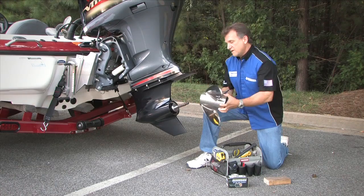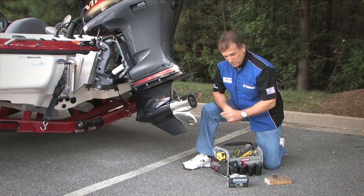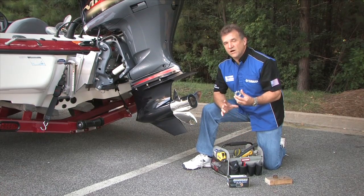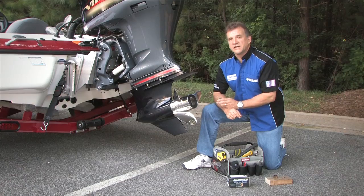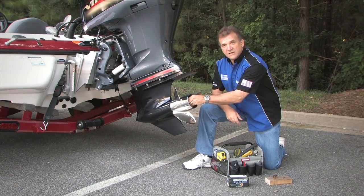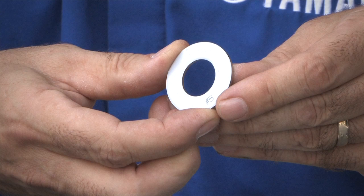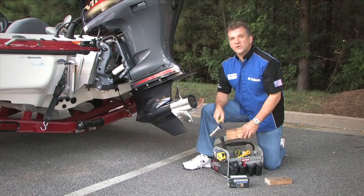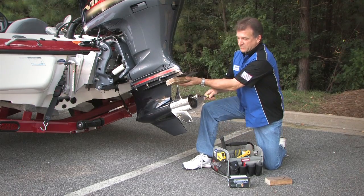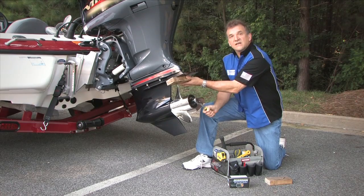Make sure you've changed out the thrust washer. Next, you want to install the spline aft washer — remember, this is the one that came in the kit. Always use the hardware that came in the kit with this style of propeller. Simply put this on the end of the prop shaft and make sure that you have some engagement there. Go ahead and use the flat washer that comes in the kit, then reuse your propeller nut that you took off earlier. Tighten it up using a block of wood and a good quality wrench — you want that thing good and tight.